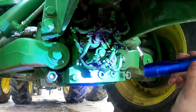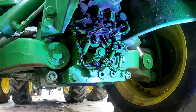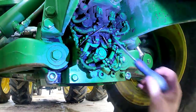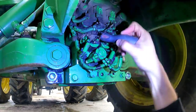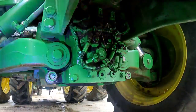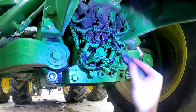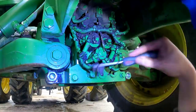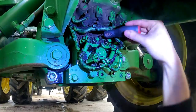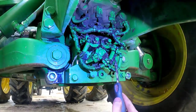So we're under the front of the tractor here in between the two front tires, and we noticed a little bit — or a lot of a bit — of an oil leak. You've got all these solenoids, so there's probably a bad O-ring in one of them, but which one? So that's what we're going to do right now — since I filled it all back up with oil, we can pressurize it by just turning the tractor on. We're going to clean out all the big stuff, then use brake cleaner on the small stuff, and hopefully pinpoint which solenoid is leaking and just replace the O-ring.